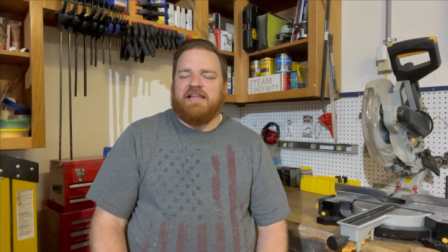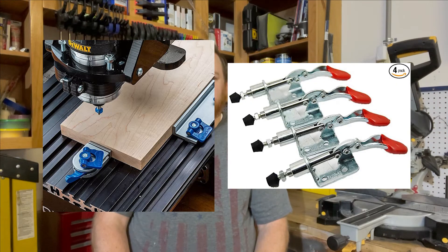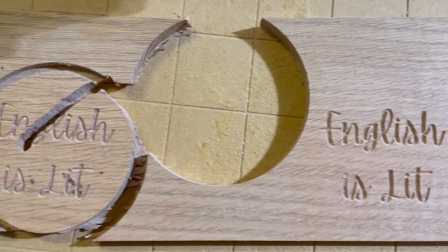When I built the table for the CNC, I knew that I needed a waste board and a way to clamp pieces down to it. I'd seen some people simply use double-sided tape. Others use a threaded waste board and a variety of side-pressure clamps, and still others insert T-tracks into their waste boards so they could use top-pressure clamps. For as much as I researched, I really wasn't sure what the best option was, so I decided to start with double-sided tape. This has actually worked out really well for the most part. I was cutting some coasters from a piece of oak using a quarter-inch down-cut bit. The power of the router and the bit was too much for the double-sided tape, and about halfway through the cut, the piece of wood came loose, shifted, and boom goes the dynamite.